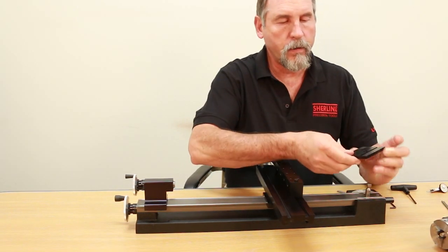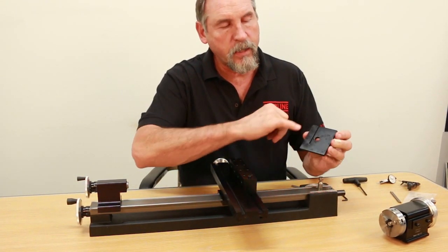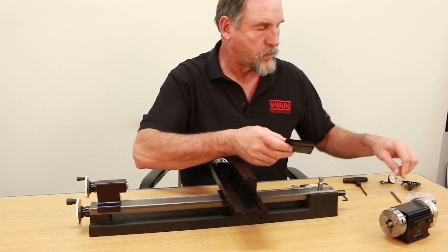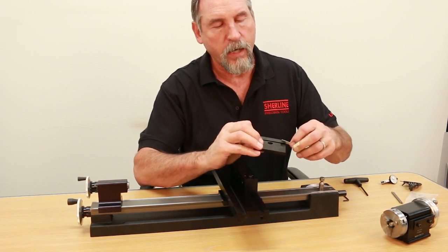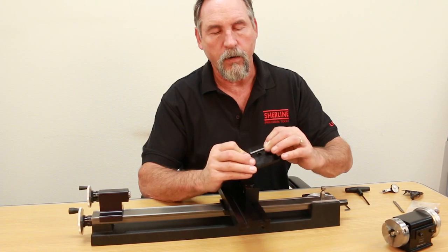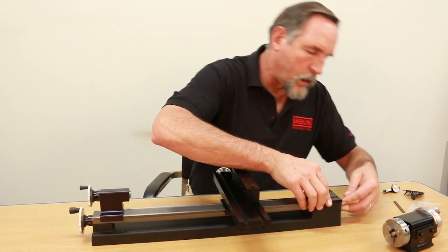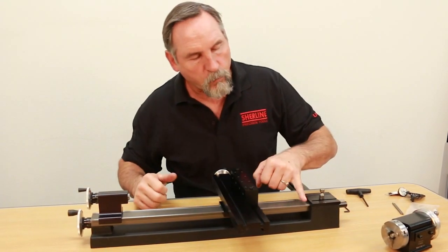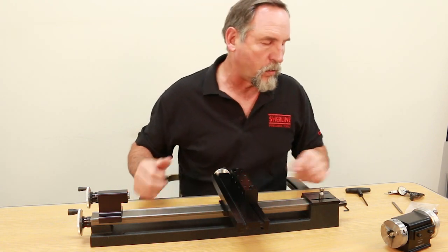On your headstock riser block, on one side the keyway is cut almost all the way from one end through to the other. On the other side, the keyway is only cut about two-thirds of the way down. The side that's cut two-thirds of the way down is the side that goes down. You put your keyway in here — the keyway has two sides that are ground and two sides that are not. The ground sides go in either side of the keyway cut into here, and the unground sides face up and down. Hold it like so, put it over the pivot pin, and line it up. If the position is proper, there won't be any gap between the bottom of the spacer block and the top ground surface of the bed. There will always be a gap within the middle of the bed extrusion.